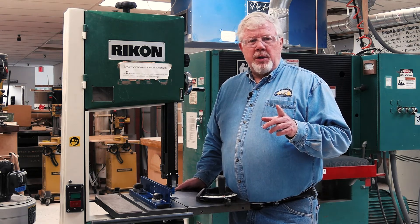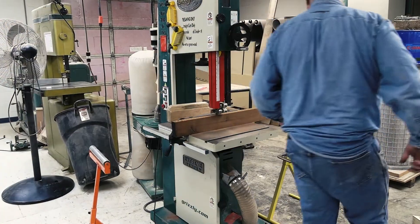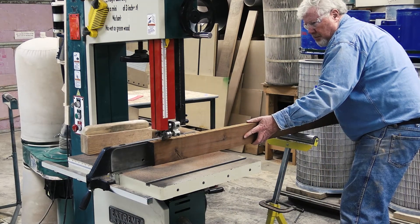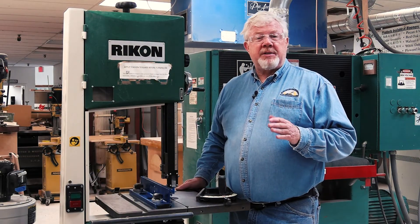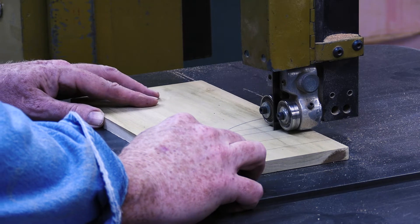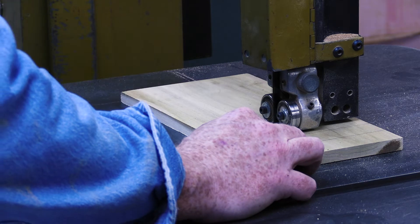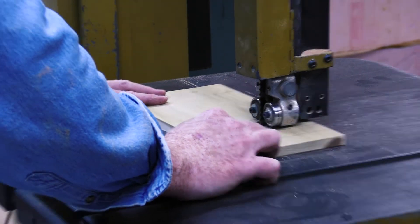While resawing wood, it is okay to start your cut when standing on the infeed side of the blade and letting go of your workpiece, circling around the machine to the outfeed side of the table, then pulling your material through the blade. Again, make sure you are drawing the wood through the bandsaw only as fast as the saw is able to handle cutting the stock. If you're not cutting all the way through your stock, don't back the stock away from the blade without turning the machine off first. Turn the machine off and wait for the blade to come to a complete stop before backing out of a cut.